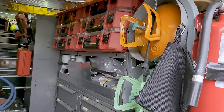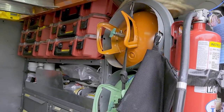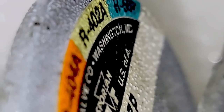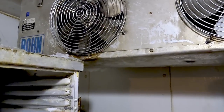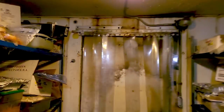You know what? Good grief. I still need to look. I need to make sure that TXV head, it could be 22. It could have been 502. I'm not even thinking today. Yep, 404, 502. Coil's clean. I wanted to make sure, because man, that would suck. It could always be 22, especially when it's this freaking old. You can't take anything for granted, because man, it will bite you.